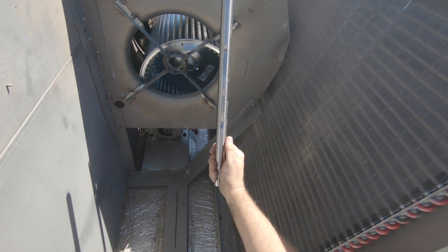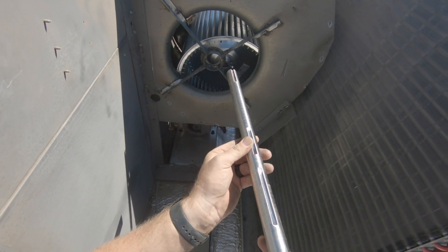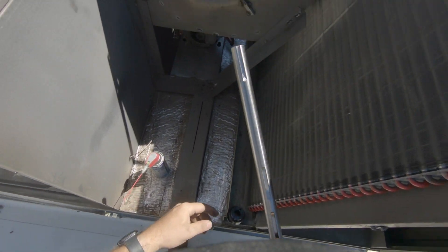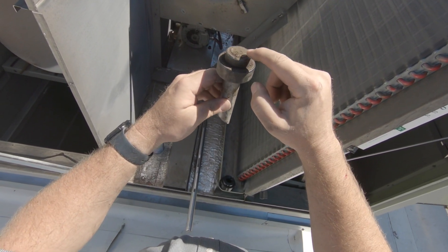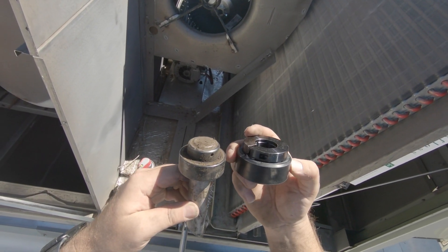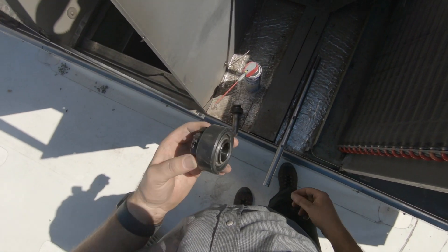This is our new shaft. Pay attention to the keyways — there's no keyway here, we have a keyway here and a keyway here: one for the blower and one for the front pulley. Make sure you orient it correctly so the pulley ends up on the right side. For mounting the bearing, looking at the old one, it's about a sixteenth of an inch sticking out — we'll match that. You would normally put some anti-seize on here but I don't have any.